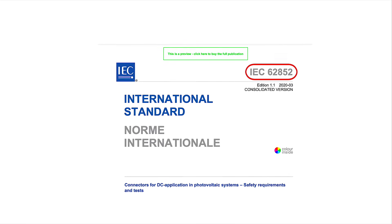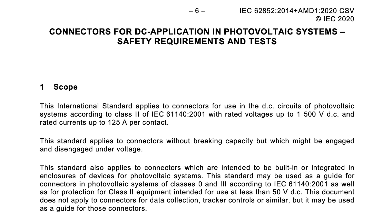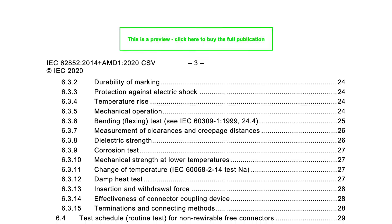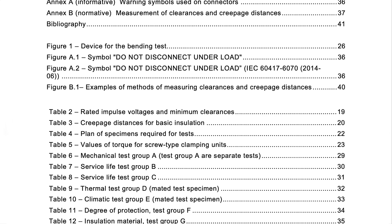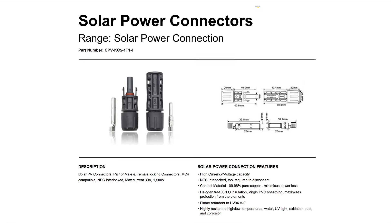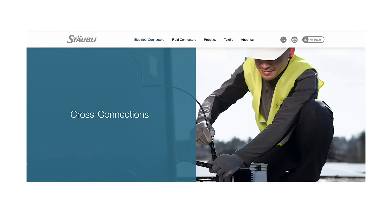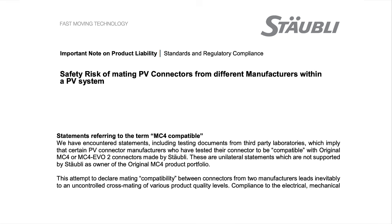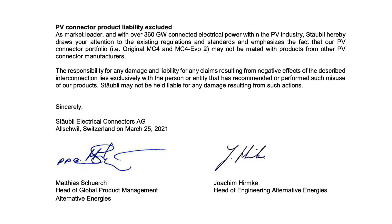Is this a problem if the connectors fit together? At first glance, the performance of solar connectors may not seem problematic, as it is governed by IEC standard 62852:2014, amended in 2020. However, this standard does not specify exact connector dimensions or the type of crimp connector required. It merely states the exhaustive tests that should be conducted on a family of connectors, which means plugs and sockets from the same manufacturer must be used together. While some manufacturers assert that their connectors are compatible with Stäubli MC4 or claim to have undergone independent testing with Stäubli connectors, it is important to proceed cautiously. Stäubli does not provide a compatibility chart or endorse any third-party connectors for use with their original products.